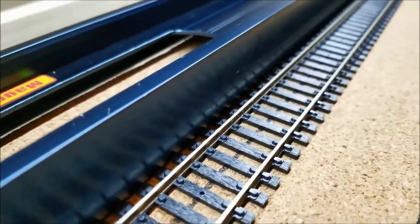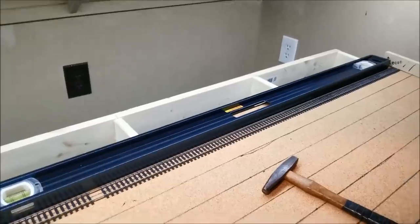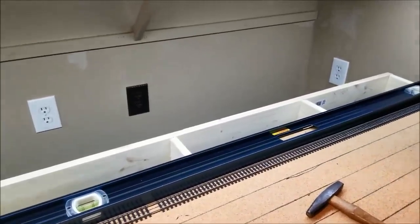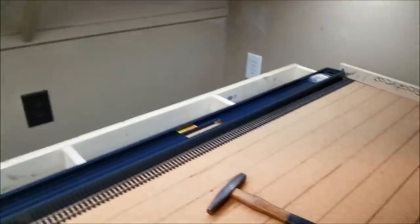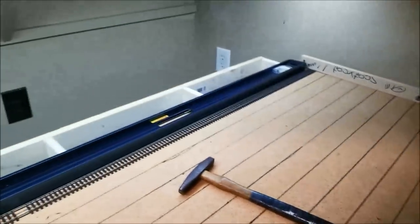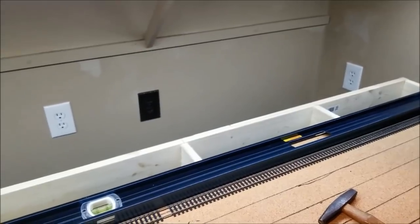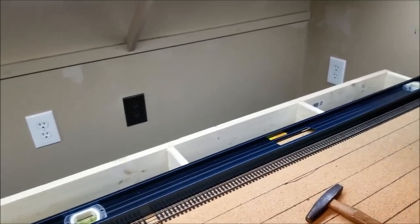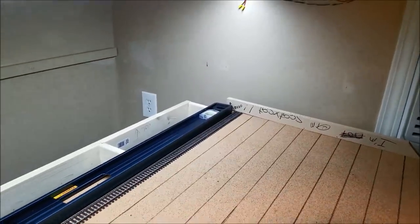When I say wait a couple of years — the problem with this is it's all new wood, there's moisture in it. I'm about 15 miles from the Gulf of Mexico here; humidity is always high. I don't keep the air conditioners running — too expensive. So the wood's got to dry out. We'll run into periods where it'll dry out, which means everything here is going to shrink. It's not noticeable to the human eye, but that little track right there, it's enough to affect it, plus you get expansion and contraction.